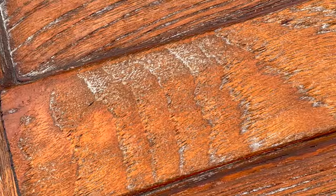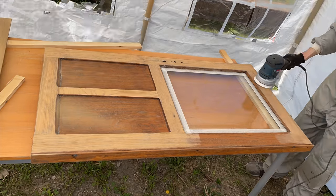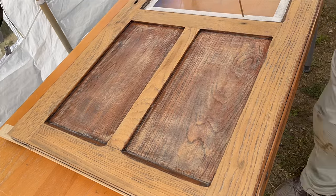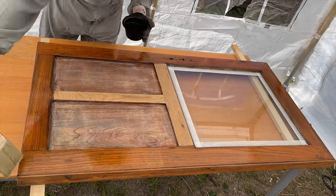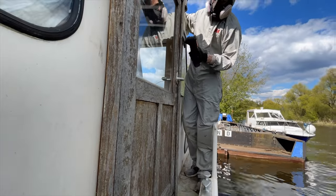There were also white areas inside the grooves created by the wood grain. So I went ahead and sanded the first door some more, this time with an orbital sander. Then I put down another coat of boat lacquer, and in the meantime, while letting it dry, I started working on the starboard side door.